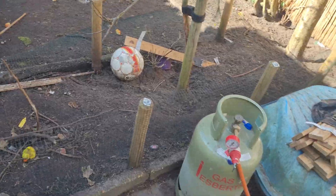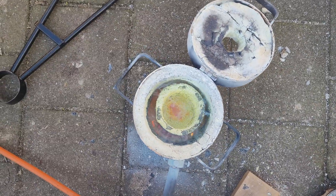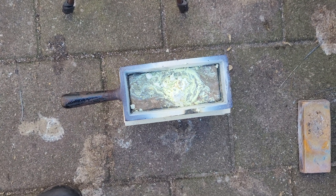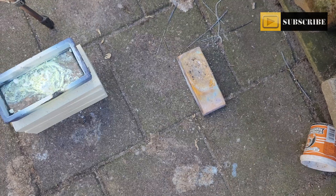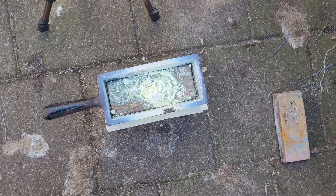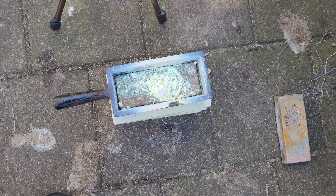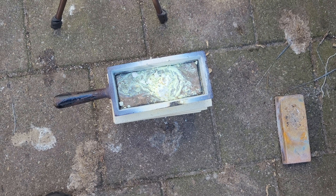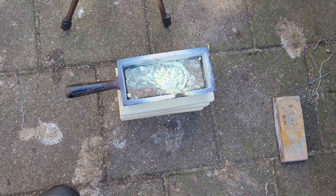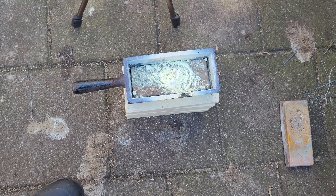I got to remove the chickens because otherwise they will burn themselves. The bottom of the crucible is still full of copper that has already solidified, so I've got to remelt this ingot. I got one good ingot and one that's probably just a kilo. The other one will be two and a half kilos. I'll remelt this together with the copper and add a tiny bit of zinc and mix it up. It gives a lot of smoke and flames, but much safer. I already mixed once before — it was the Nordic gold.